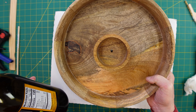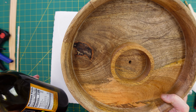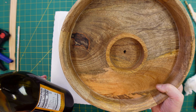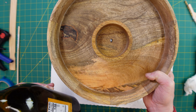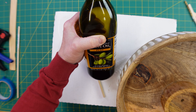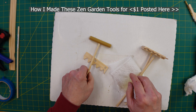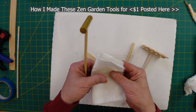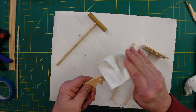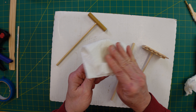If you're going to use it for any kind of food you want to use straight olive oil instead of boiled linseed oil. I found out from the container that boiled linseed oil can spontaneously combust, so I'm not going to use that as much — maybe only outside for wooden tools like axes and hammers. For things that you might eat out of, definitely go with something like straight olive oil. Olive oil is actually good for your skin too, so don't worry about getting some on your hands — but you can wear gloves if it bothers you.